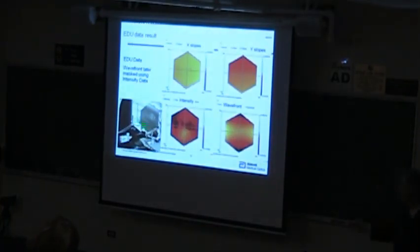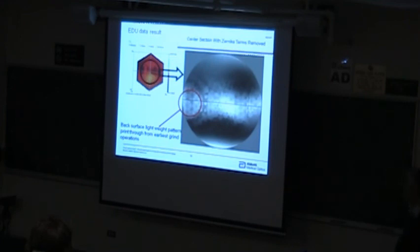And here's a picture of one of the mirror segments. I think the region that they've actually started grinding on is right here, and this is the unmachined image that just hasn't been ground on yet. You don't see much when you look at this, because it's dominated by big astigmatism terms. But once you subtract out, remember I was telling you the difference between the modal and the zonal? So you subtract out that modal, then you can start to pick up these structures.